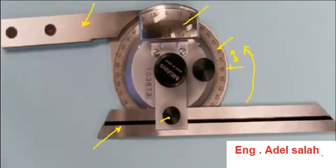If you have a look just underneath this magnifying glass here, which is used to help magnify the measurement because it can be a little tough to read, we actually have the vernier scale. This scale is divided into two quadrants of 12 divisions each, and it's trying to break a degree down into 12 parts, or five minutes of a degree. So the accuracy of this tool is five minutes of one degree.